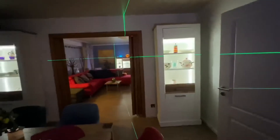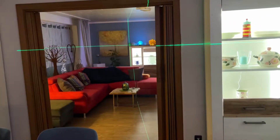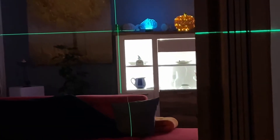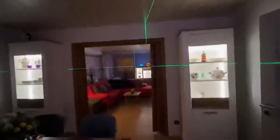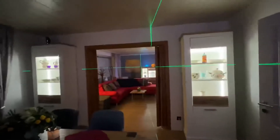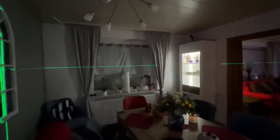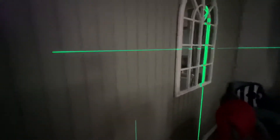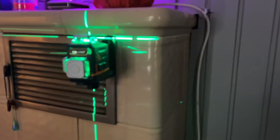Using unmentioned operations or adjusting the equipment can lead to dangerous radiation exposure. While the product is in operation, be careful not to expose your eyes to the emitting laser beam. Exposure to a class 2 laser beam is considered safe for a maximum of 0.25 seconds — light reflexes normally provide adequate protection. Do not stare directly into the beam or use optical instruments, and do not set up the laser at eye level.